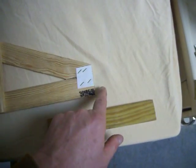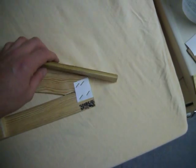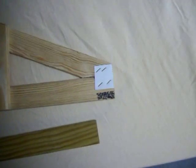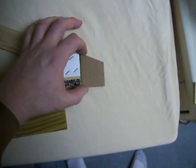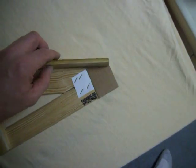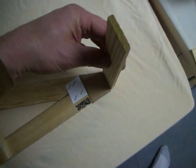In addition, the chimney is not going back up, so we have to do something to replace this. And this is the proposal. The proposal first is I have to continue the roof down because the chimney is no longer coming up through here. So I will need to take a piece of 2x4 like material and put this right on the end of that as one solid piece. And then of course the roof is fully supported so if somebody steps up here on the plywood it just doesn't collapse. We can't just have this dangling out here, and then of course we've got the fascia board that would go to the end of this.